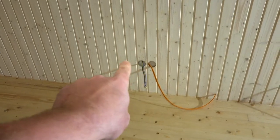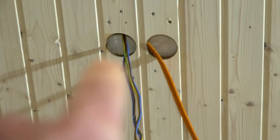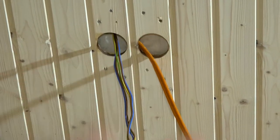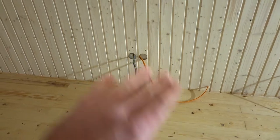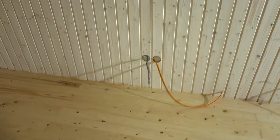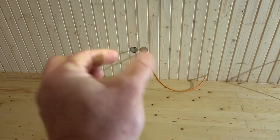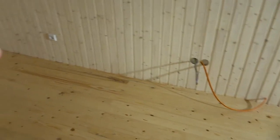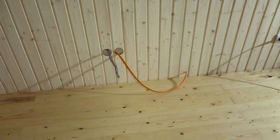The reason for that is we made a mistake with this hole. When we cut the hole, I didn't decide what kind of connectors we'd use. Now the connectors I have are not fitting — only the distance is the issue. The diameter is exactly the same regardless of brand, but the distance unfortunately depends on the model you choose. What I chose is really simple — we have a lot of these from some kind of demolishing, including ethernet connectors. So on the end, I didn't have to spend zero euros on my main outlets and also on my ethernet connections.